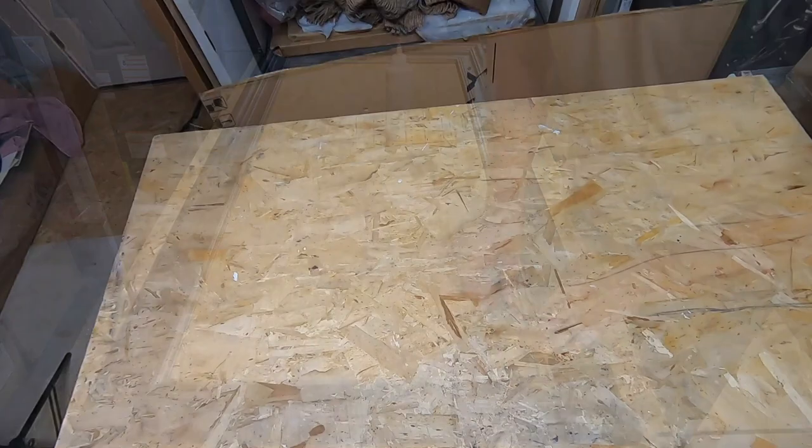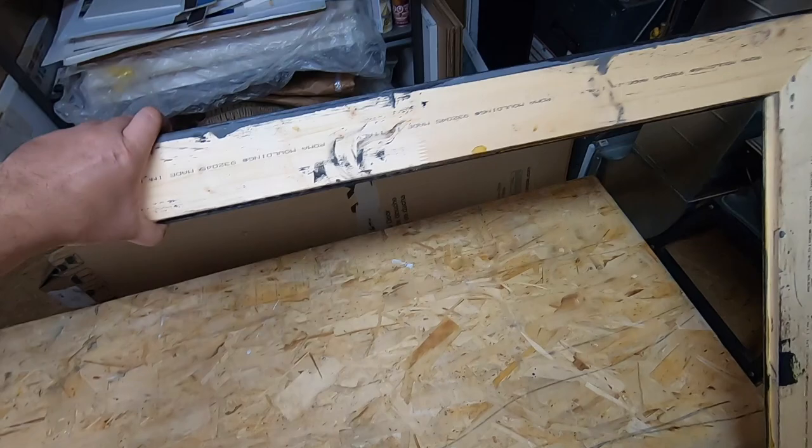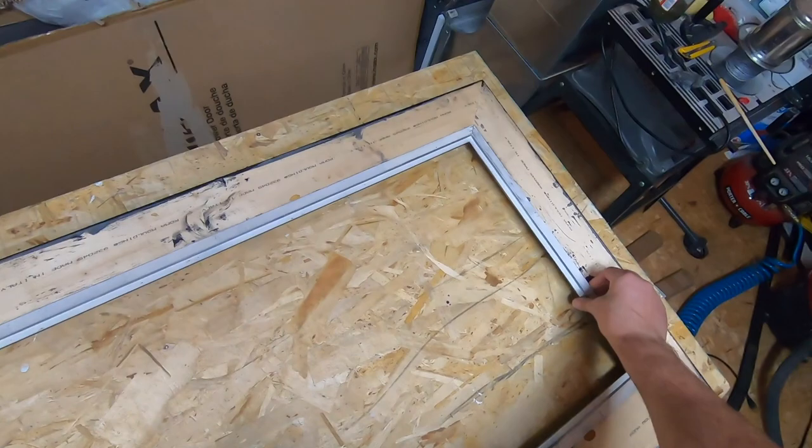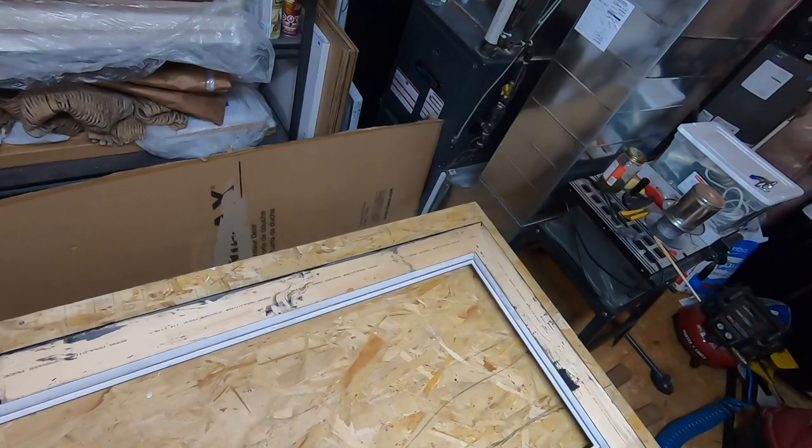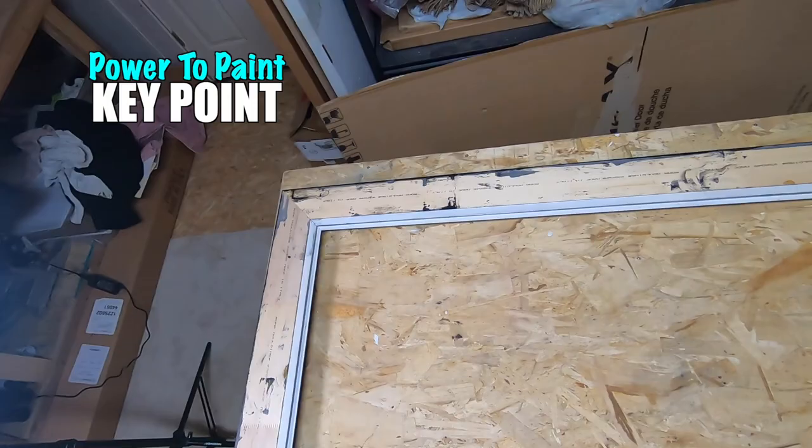Right, so let's get our frame up here. And we'll lower it down and we'll insert our nice fit. Did a good job on this one. Sometimes I have a little more than a gap. You actually want a little bit of a gap to accommodate for the swelling of the wood, so we did a perfect job this time around. Lucked out. All right, so we'll get the pinner.